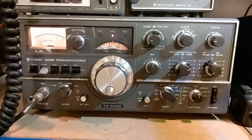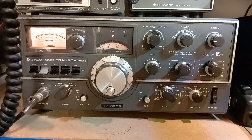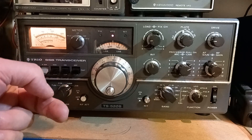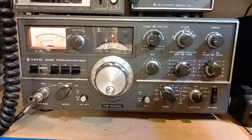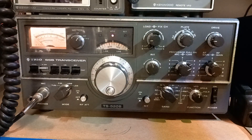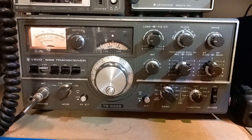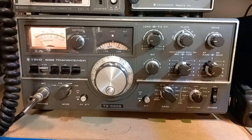So you've got your power switch — that's obvious. Switch on, radio comes on, a little bit of volume there. First thing to remember is your heater switch for the valves. This is a hybrid with three valves: a driver and two finals. Switch that on, give it about 30 seconds to warm up, and then we can begin. What some people forget — and I've done it myself — is I've turned off the heaters because I've been using it as a receiver, then picked up the mic and nothing happens. That's because I didn't turn the heaters on. Valves are called tubes in America.